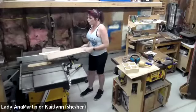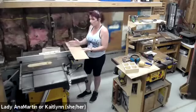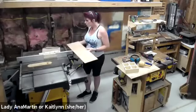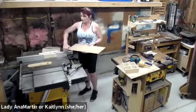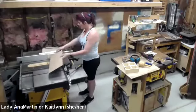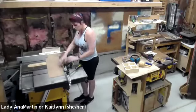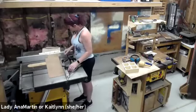When I'm cutting along the grain, this is called ripping. And when I cut across the grain, it's called crosscutting. Never, ever, ever use the rip fence for crosscutting. So what I've done is I put my block here again. I have set the distance and I'll use my crosscut sled